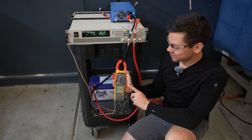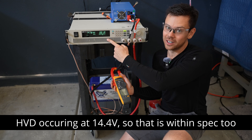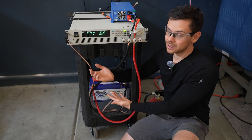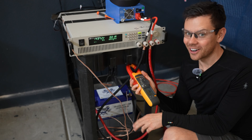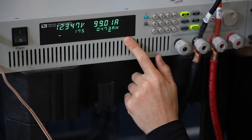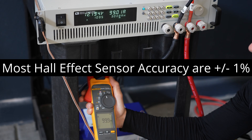This is the new test system and we're charging with 49 amps. This is a higher quality electronic load so I don't think we'll have any issues now. It also has remote sense leads so it's a little more accurate. Now we are fully charged so we can do the load test — we're drawing 99 amps and with the meter we're at 99.9 amps solid.